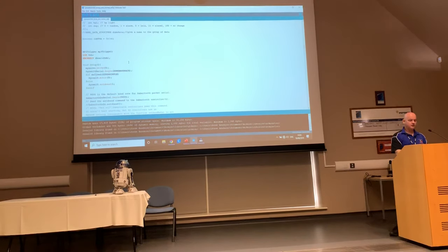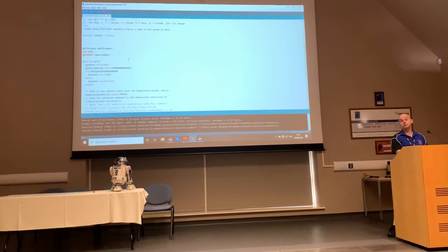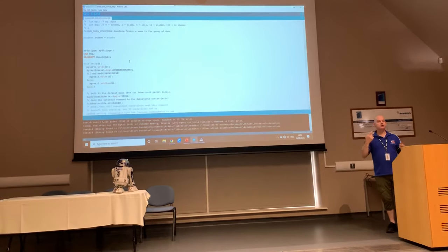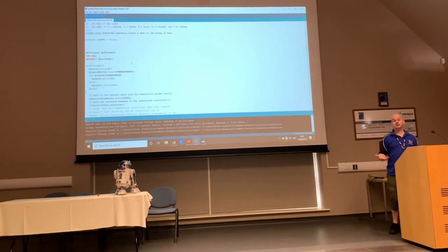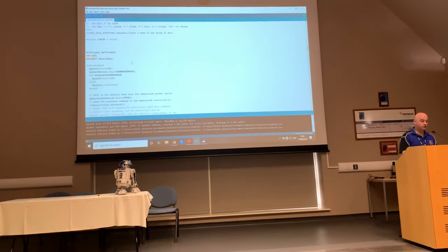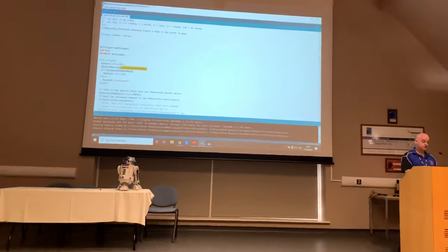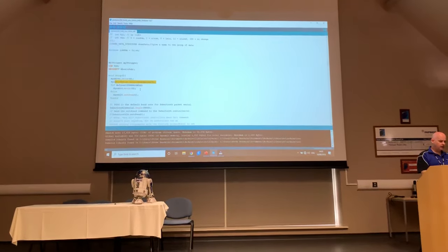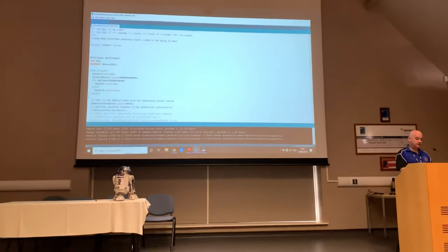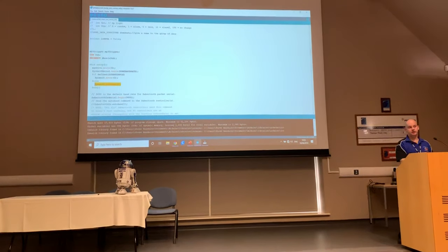We then go into what's called void setup. You're also going to see shortly something called void loop. The void setup is a bunch of code that runs once when your Arduino is powered up, okay? It is setting stuff up. Very, very useful. So basically, we're telling it to write servo positions. We're telling it to start communication with the Syren 10, if it's been defined. Or we can say, okay, if it wasn't defined, you can use auto baud rate. In other words, it will actually try and figure out its communications itself.